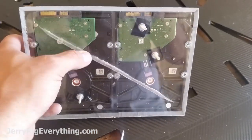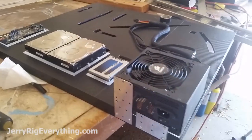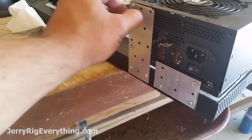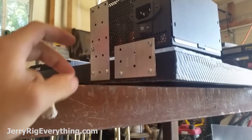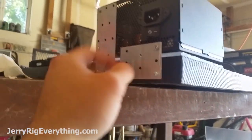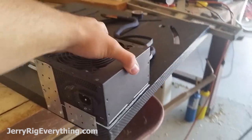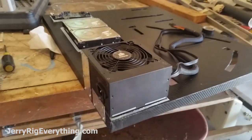It still has that same little line to help guide the light into the outside edges. Mounting the power supply is a little bit trickier — I took some framing brackets and put screws through the frame of the case and screwed it into three of the four power supply slots. I think it's honestly pretty sturdy; I'm not worried at all about it coming off.